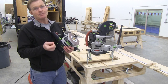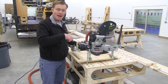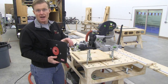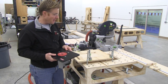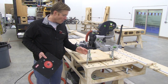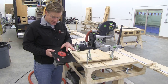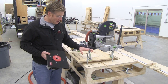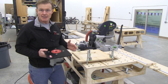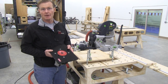All I have to do is add that one-eighth of an inch, which is the differential between the outside diameter of the cutter and the outside diameter of the guide. I add that eighth plus a little bit more, because when I finish the cutout I want it just slightly larger than the plate so that I can dial it in for a nice firm fit. So the one-sixteenth I add all the way around in length and width is to factor in the template guide.